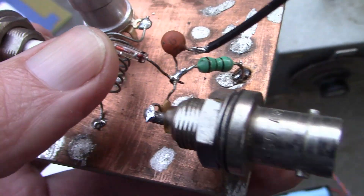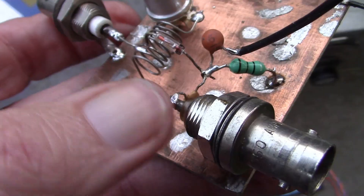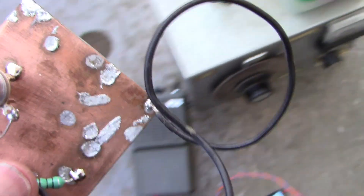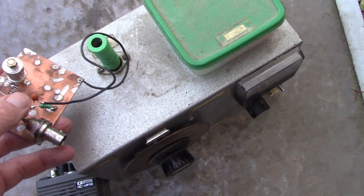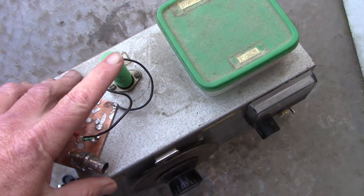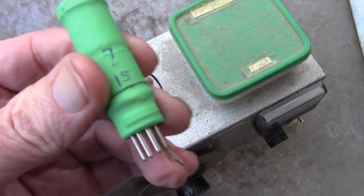You can see there are two connections — one via a 30 picofarad capacitor, whose value is not critical, that goes to the receiver. So you've got 150 to 158 MHz out there. Here you've got an input, and this is an HF input — it's around 5 to 15 MHz — and that is what this local oscillator here is for. This one happens to be a grid or gate dip oscillator. It's actually used for testing tuned circuits, and this is what we used before modern antenna analyzers. These types of units often had plug-in coils, as described on my website. These plug-in coils give you various bands — this one does 7 to 15 MHz, which is about what we need.